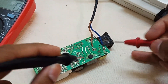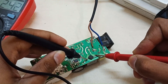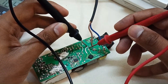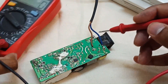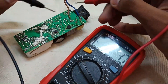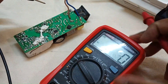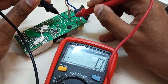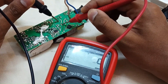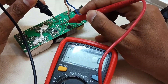Trace the path and continue towards the capacitor — this one. You can see that there is also 240 volts here. This 240 volts goes to the next big inductor — this one. The other points of the inductor are here. You can see that there is no voltage on that side. So one side of the inductor is 240 volts and the other side has no voltage. The first problem is here — this inductor is not working.